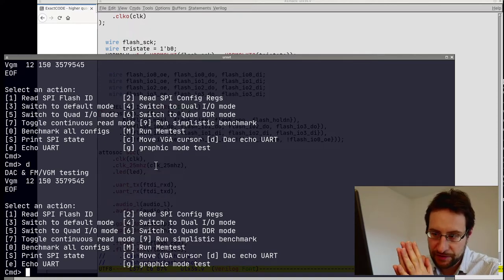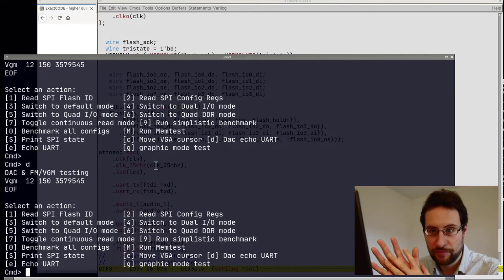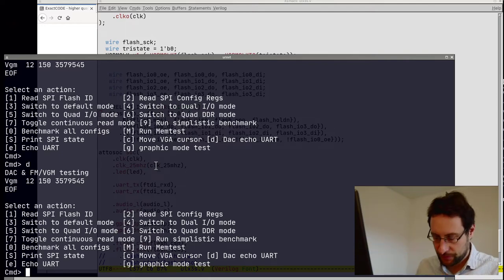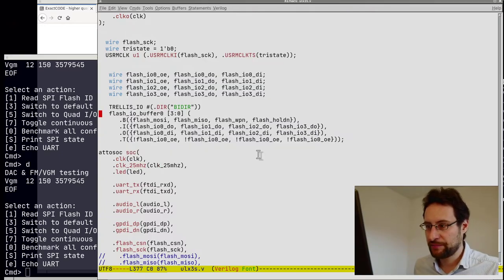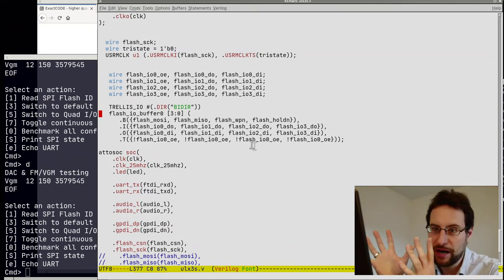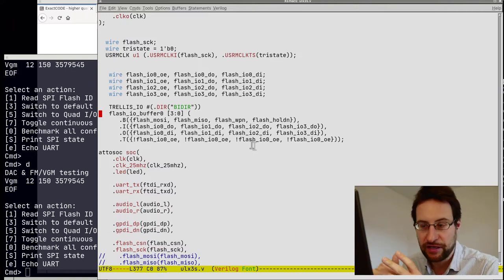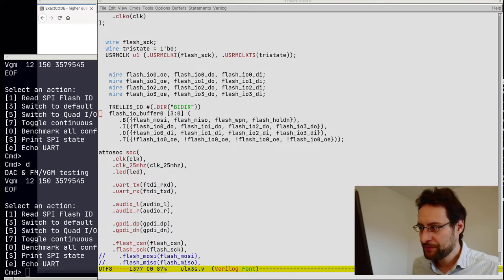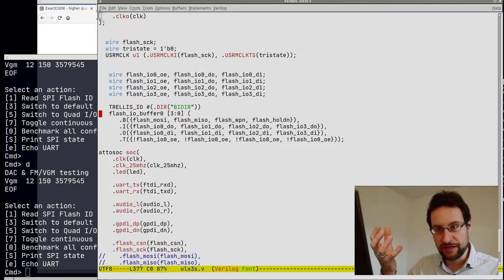The other difference is this is right now running hardware instructions for multiply and divide — something we didn't have enough logic elements for on the icebreaker's iCE40 compared to the ECP5. It took way too many hours to get SPI flash working at all. Now I have it running in quad SPI mode, which means we now have much higher performance.